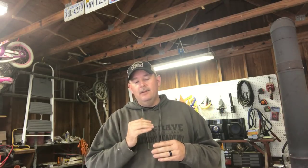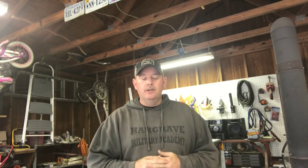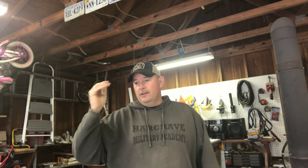I built a trial run with some scrap wood using pocket holes with a Kreg jig, but the pocket holes wouldn't work on the lid so I had to glue it and use a brad gun and brad nails. After the glue dried I really worked on it trying to pop it apart and it's holding strong with Titebond 3. So it hit me - I don't need all these extra steps with a Kreg jig. I'm going to build the rest using nothing but a brad gun and glue. I've got enough material for seven of them, and other than my miter saw and maybe the table saw, this is going to be a breeze.